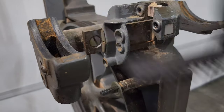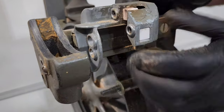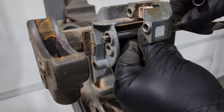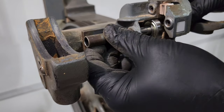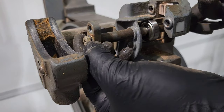First thing we need to do is get in there and clean it up. Just a brush, give everything a quick wipe down, and make sure stuff moves freely. These blade guides can be stiff when they move side to side. Please do not spray any oil or put any sort of lubricant down there, because the first time you run that saw, all that dust that falls down there will be attracted to that oil and stick on there, making it impossible to move the blade guide side to side.